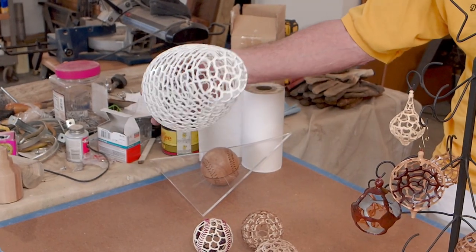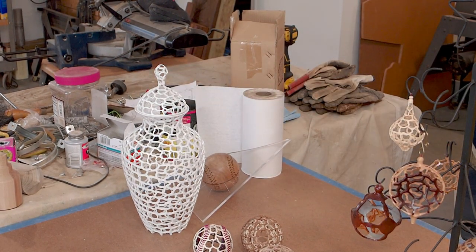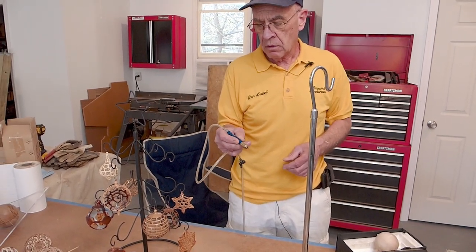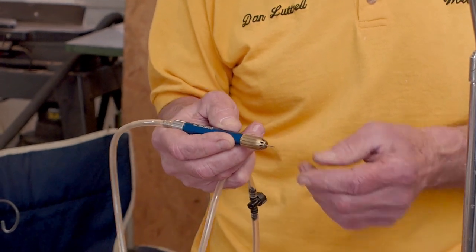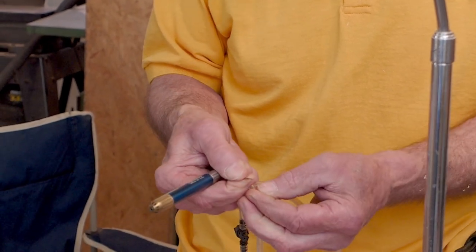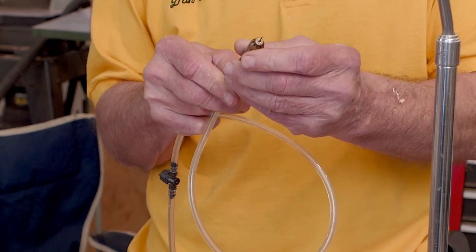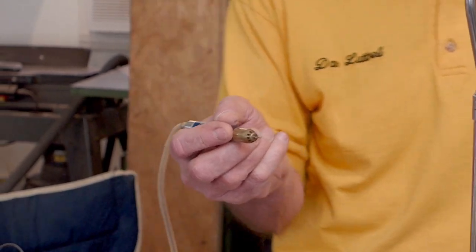That's another story when you have to think about the thickness of the bottom, because you can't use a gauge on something like that. So I use a dental drill type carver. This one is a Vortex F5. Paid a lot of money for this. Jim Zorn uses an actual dental drill, which is about the same thing, uses the same size burrs. Twist this and remove and replace that burr. It's a straight spiral, a long burr, which reaches in to this 3/32 maximum depth cut that you're looking for.